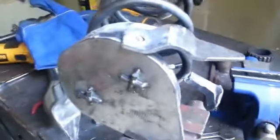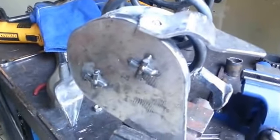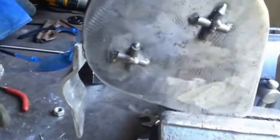I'm thinking that's the ticket right there. So right now I think those ears turned out great. One thing I do try and do is, even though those ears are just kind of little critters, if there's a big ugly hole or something like that, like on top of the ear right there, I'll just kind of fill that in with weld and take the grinder, grind it flush. Same with the eyes, you know, you're not going to get a full real weld on something like that. You just put a goober on there, and then you'll take your grinder.